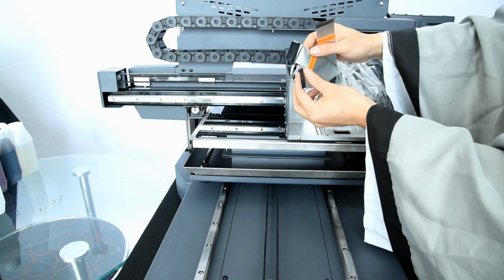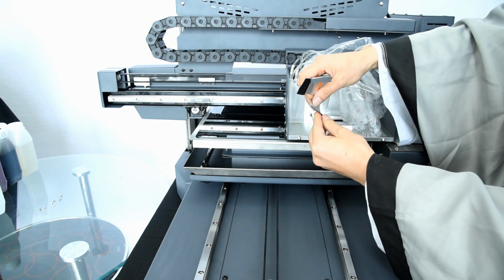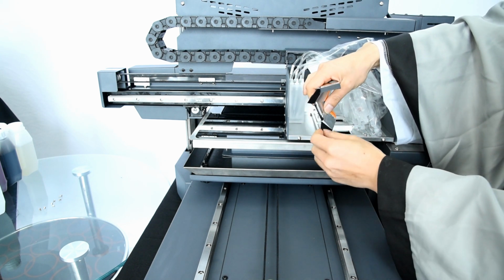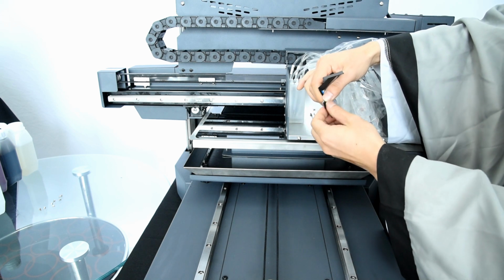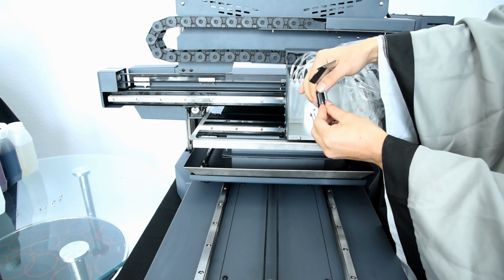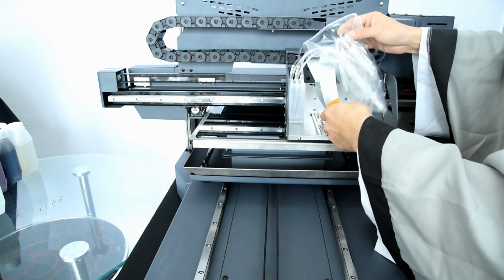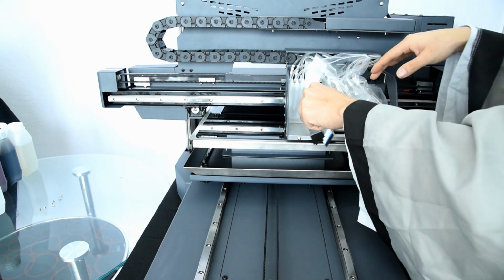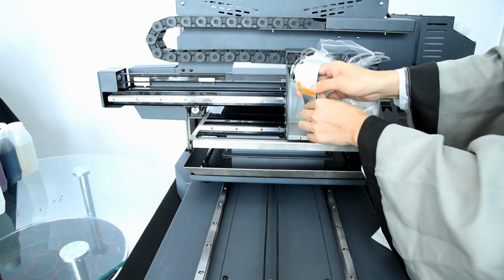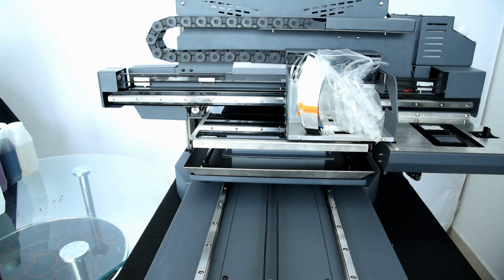And be sure the cables are not shorted with each other. The tape is to protect the wire. Otherwise, if you power on the machine, the pins connecting to each other will be shorted. And be sure the cable and the ink damper will not go into the hole and block the carriage moving. Then we install back the cover.